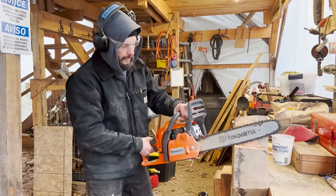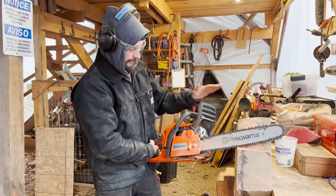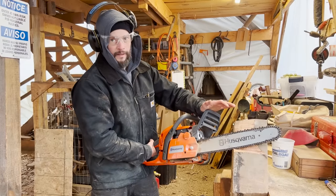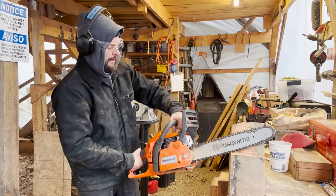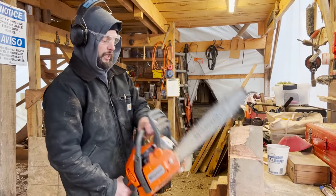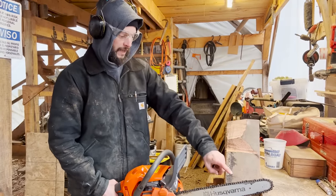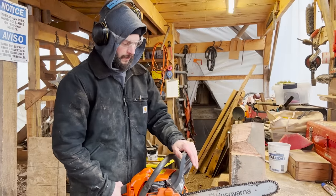And now, one thing that is really dangerous with the chainsaw, and it's why it has this brake on the top, is called kickback. So what this brake does is, if this saw jumps back and your hand hits it, you hear that click? That's locking the chain. And the reason is so if you're cutting and it kicks back and this chain comes up to your face, you are physically not gonna hold this. It's gonna rip out and you're gonna hit it. And you're gonna get smucked in the face with a super hot, sharp chain that hopefully is not spinning anymore. That's what the brake is for.